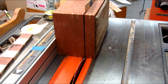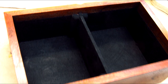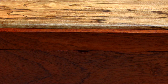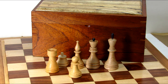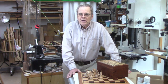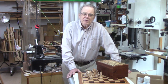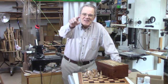Afterwards I used flocking — I'll link to another video where I did a jewelry box with flocking — but I flocked the inside to give it a nice velvet-like coat. I ground a little finger grip lift area with my Dremel tool with the drum. I added some brass hinges on the back, and I'll probably add some magnets to keep the top down snugly. If your club is interested in having me do a demonstration as part of an interactive remote meeting, please have your programs person get in touch with me — I'd be very excited and happy to do that. You know the drill: stay safe, and y'all come back here.